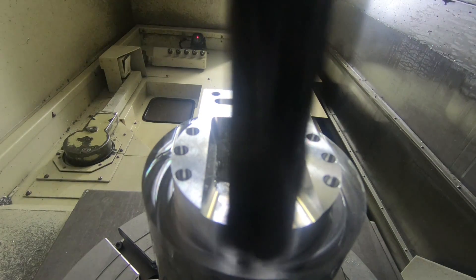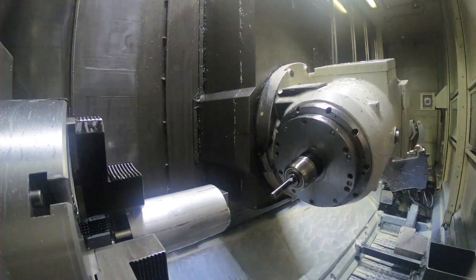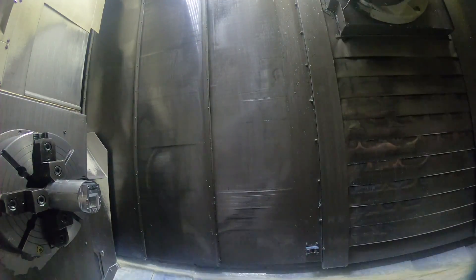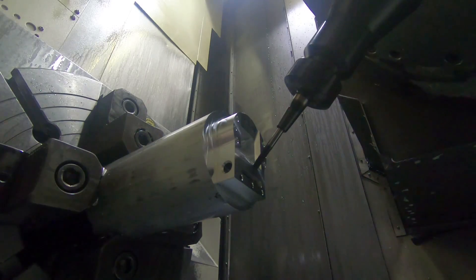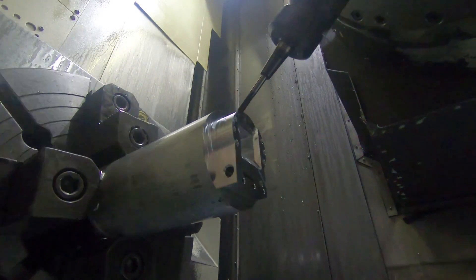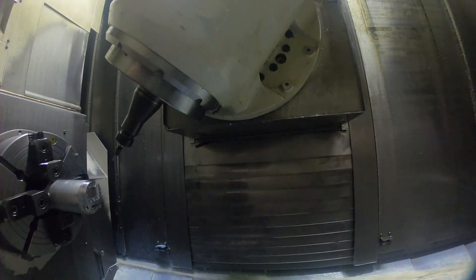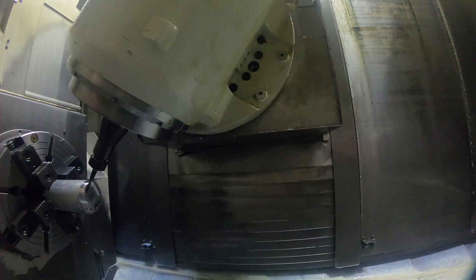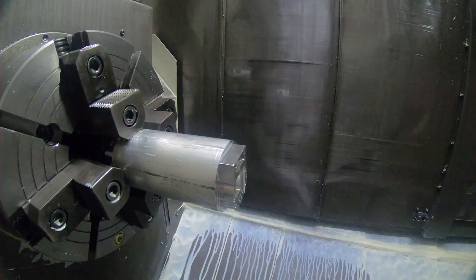Here's a view from the bottom up. Then here comes the quarter inch end mill. This is a full five-axis type of thing because I can't really reach below X zero on this machine, so I have to cut this radius using a five-axis cut. Probably not the most practical way to do it, but that's the only way I can actually reach the shape.